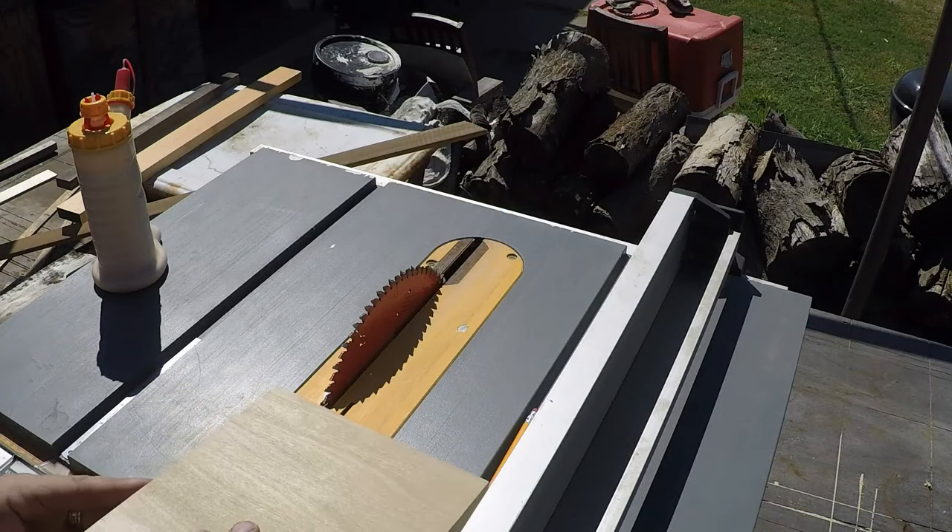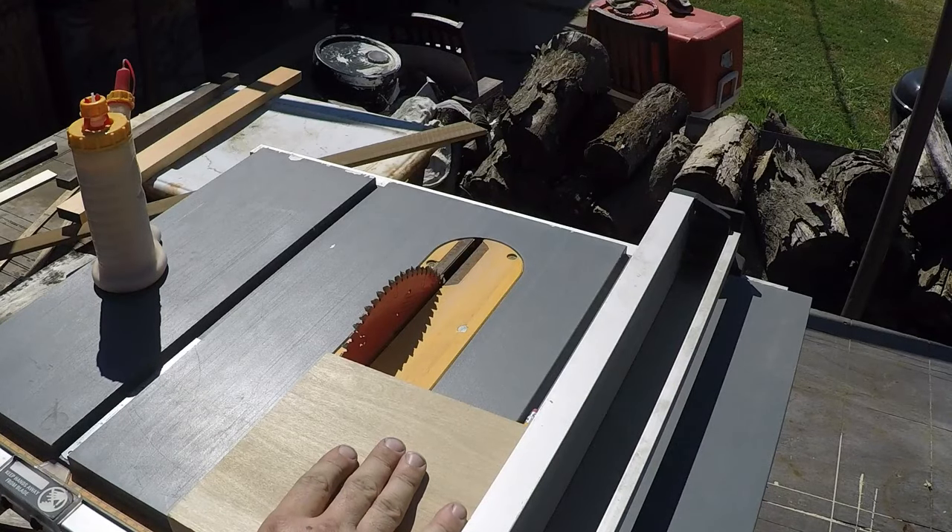We need to put our draft onto the top of this here. I've got my saw tilted just one and a half degrees — I don't want to have to machine off very much along the outside edges when we go to start working on it. I've got the cross-cut set in there; we'll do the cross-cut sides first, which is generally good practice.